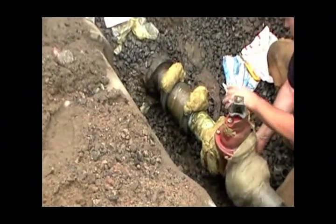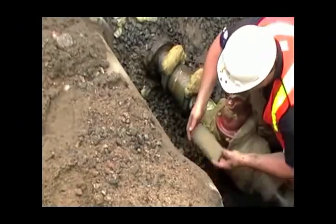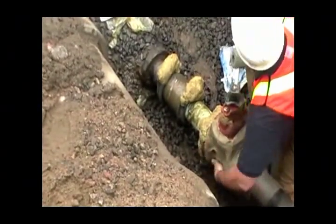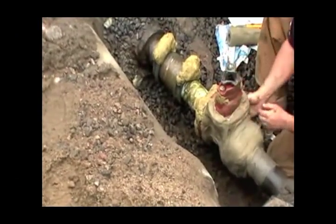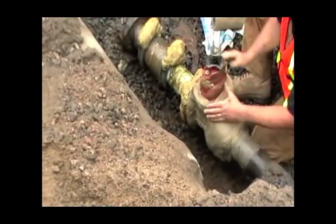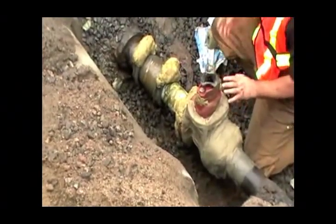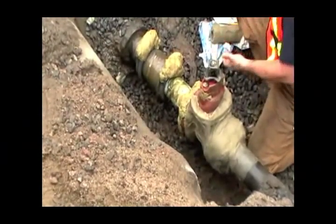What would you suggest if the valve or whatever got scratched and exposed? That's really the essence of it, Herman. That's why we tend to wrap the valves, because once they're installed, through nobody's fault, that epoxy is going to get a nick off it, and you're actually going to have a corrosion cell there where the corrosion will just target that area. It's going to concentrate right to that area. For the extra little bit of tape that you use, we just basically encase the whole thing. That way it's entirely sealed. There's nothing getting at it. It's part of the job, and it doesn't add an exorbitant amount just to wrap this little part of the body. I see. By the time you do the bolts, the bonnet, your connections, you have a minimal area that would be left to wrap anyway.